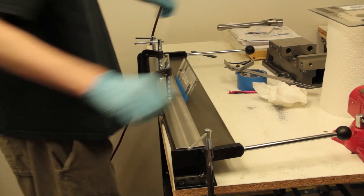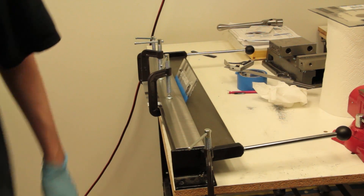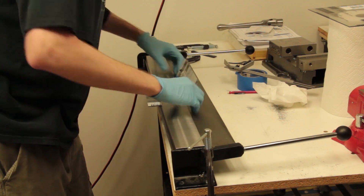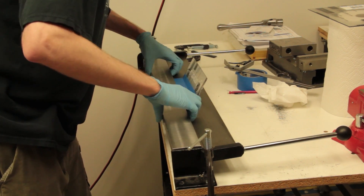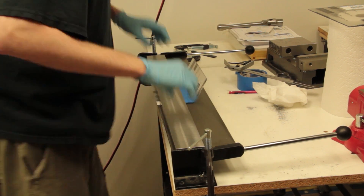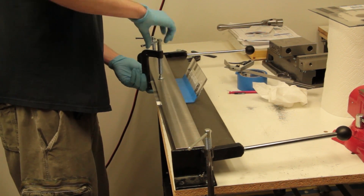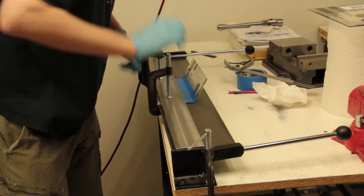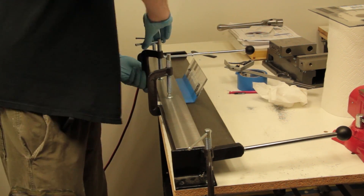You can leave the film on — in fact you should leave the film on during bending operations. Any scratches or things that may have directly affected your plastic will affect the film instead. The film won't interfere with bends like this; you can bend it with the film on and it will not cause a problem. It will peel away just fine when you are completed.